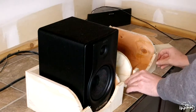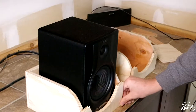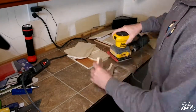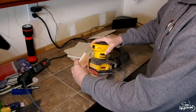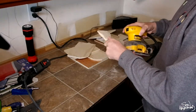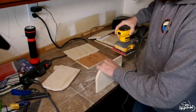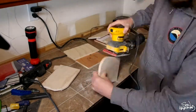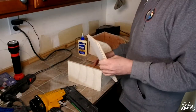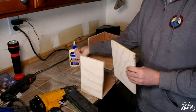Now you'll see how it all kind of fits together — that's a general layout of how these things are going to work. Sand, sand, sand your edges. I'm using 120 grit sandpaper. You want to make sure you get all your angles as much as you can. This is probably the most important and most time-consuming part of the project, but sanding this plywood will make your life a million times easier and really make it look like a professional product in the end.